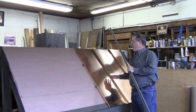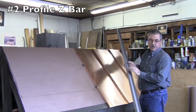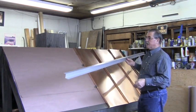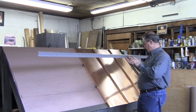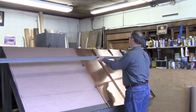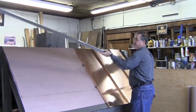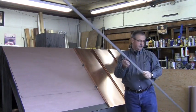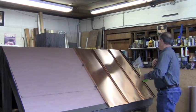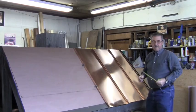Just for a matter of time we're going to move on to the next part: finishing this roof. This is a piece of Z closure — this piece is 10 feet long. We made it in another color so that it would be obvious where it's positioned on the roof. The Z closure has to be cut to fit between each one of these panels. I'm going to take this Z closure, set it aside, and measure my first panel and cut my Z bar to that size.